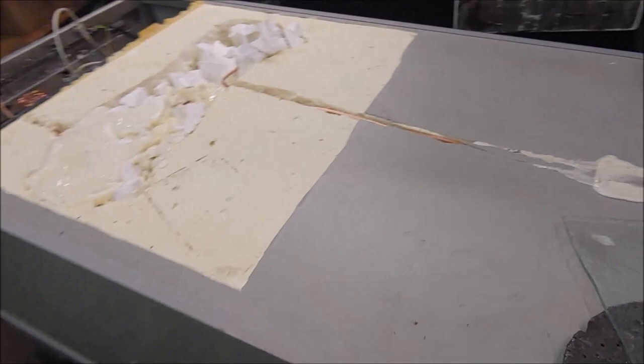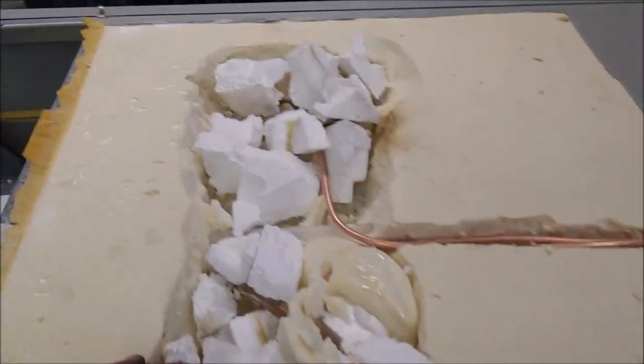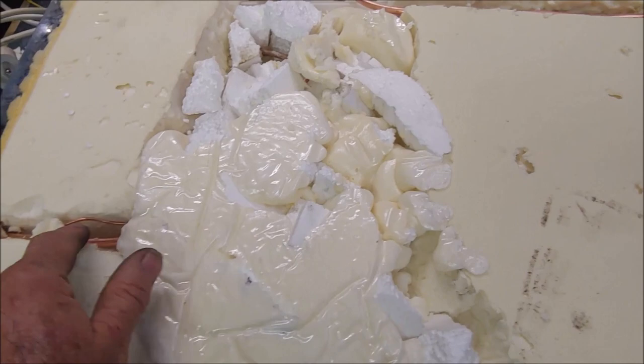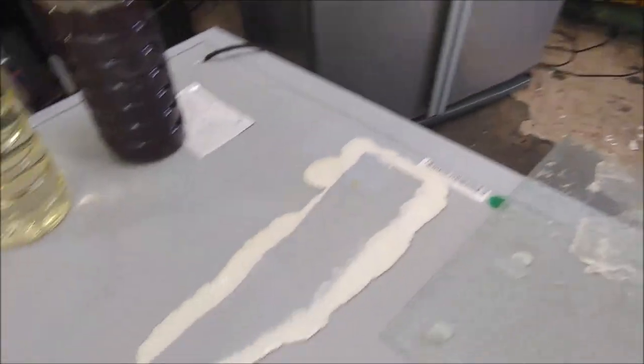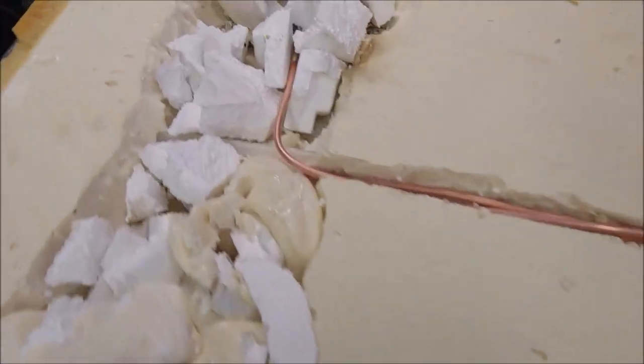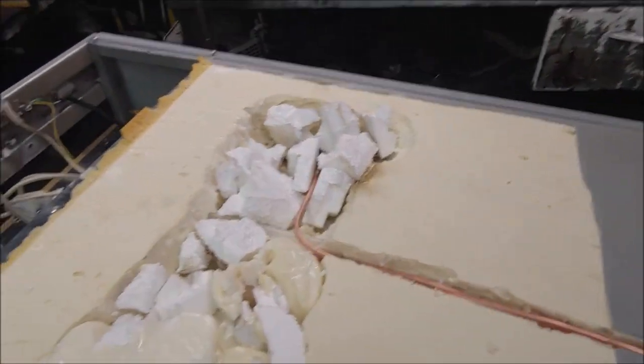On the inside, right on the top, you can actually see the little piece of styrofoam that I've put in with silicone. I'll put some more silicone on from the front just to make it look nice and seal it. I'm halfway through insulating it — the top bit is done. What I do is take styrofoam, break it into little blocks to fill up most of the spaces, then pour the foam in between. There are still a few gaps to do, and that slot I still have to close up. The foam I get comes in two bottles — A and B — you mix it 50/50. I'll put plastic on top with a glass to give a flat surface.